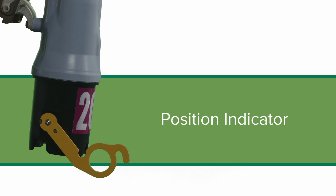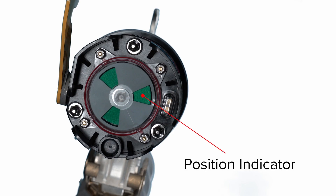The Position Indicator is located on the base of the VacuFuse 2 interrupter's housing. It contains a highly reflective, visible red or green target that indicates the position of the vacuum interrupter inside the VacuFuse 2 self-resetting interrupter. The target is green when the vacuum interrupter is in the open position and red when the vacuum interrupter is in the closed position.